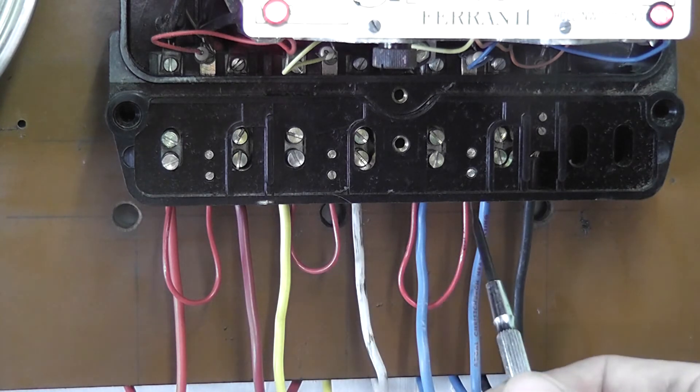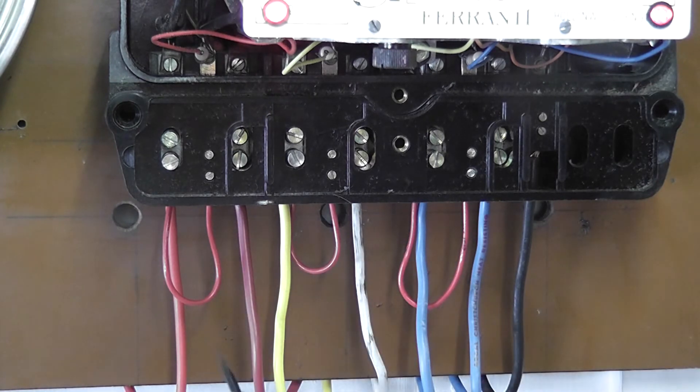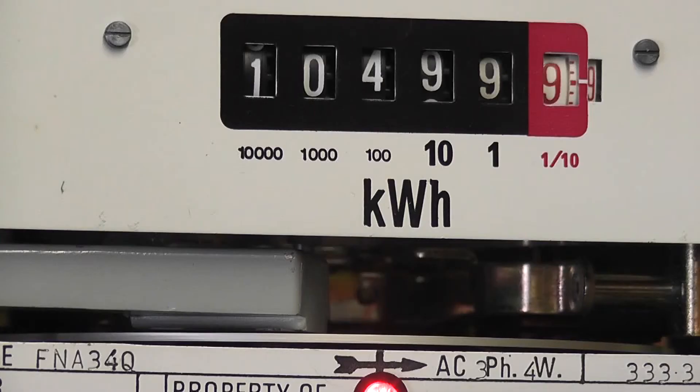There are three potential terminals — 400 volts line-to-line and 230 volts between each leg and neutral. For everybody who likes meters, we need to wait for 33.3 revolutions. The little decimal number 9 which is in constant mesh all the time is the actual meter register train. A small zero will appear and then the dial will flick over instantly. That dial is mainly for testing purposes to show the true position of the gear train. The meter is sitting on 10,049.9 and it's just about to roll over.